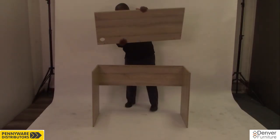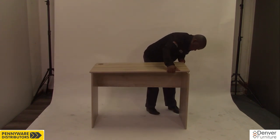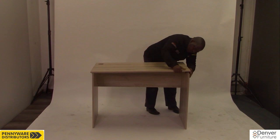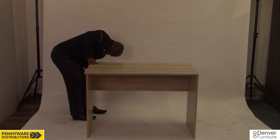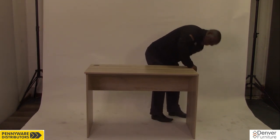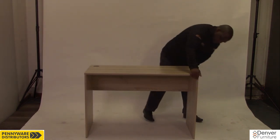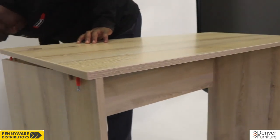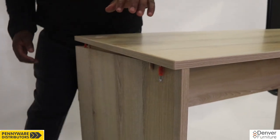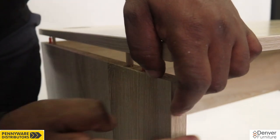Pick up the panel and turn it upside down, lowering it onto the main assembly with the big hole facing the back of the assembly — see step 5. Once the top panel has been lowered onto the assembly, line up all the protruding pins into their respective holes. Note that this can take a minute due to all the pins that need to be lined up. Don't use force. Take a look all around the product to ensure it does not get damaged because of a missed pin. Here is a close up of what can happen should all pins not be lined up properly.